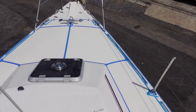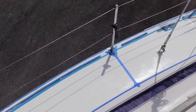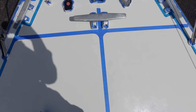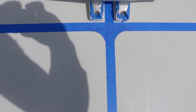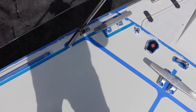We're really progressing with the deck now. I've spent nearly two days masking all the lozenge shapes out all the way down and around each of the bits of deck furniture so it'll look nice when it's painted. The hard bits are getting the curved inserts at the junctions — fairly simple using a tin and a pencil then cutting it out with a Stanley knife, but it's quite tedious and you've got to be very careful. Time now for painting the deck using International Interdeck, a paint loaded with grit which offers a skid-resistant surface.